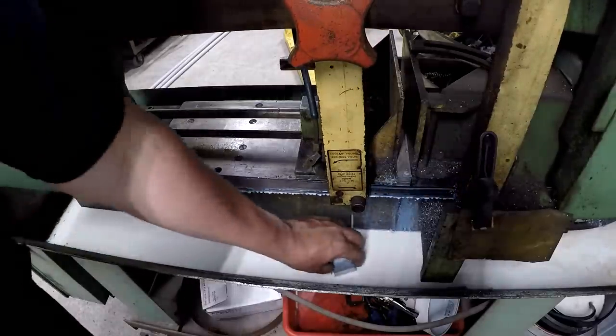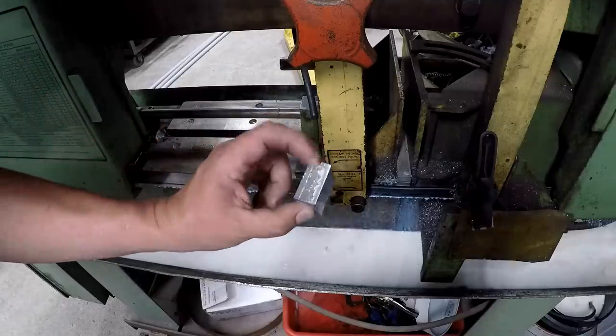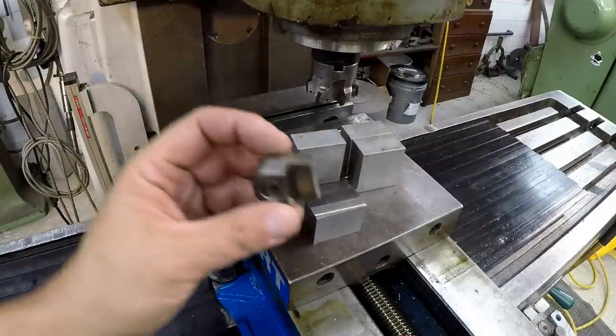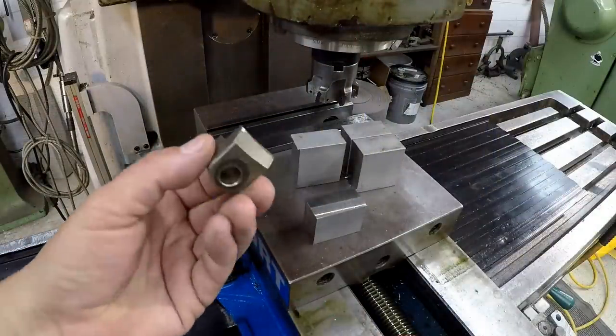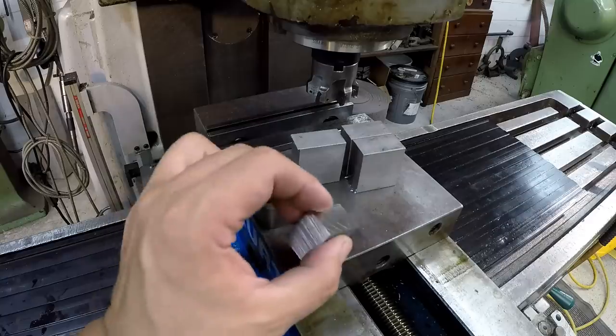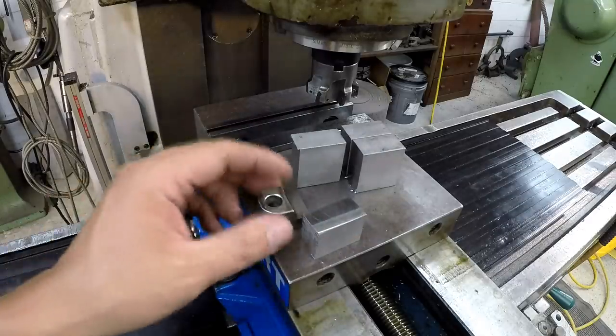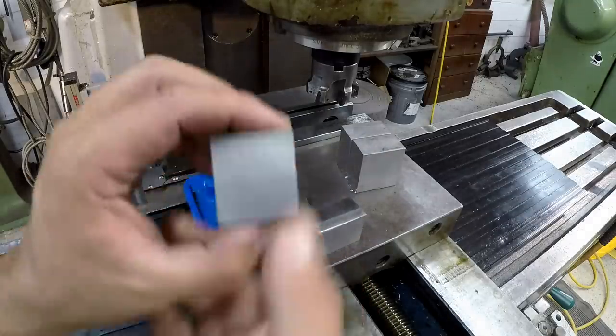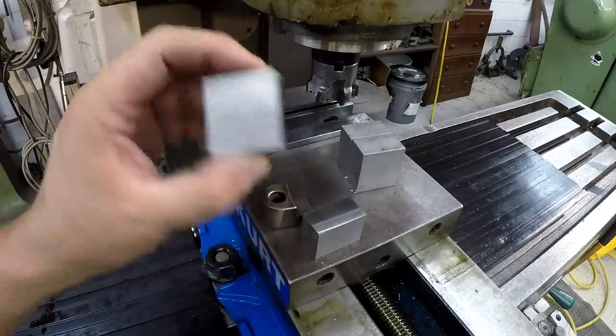That's all 8 of the blocks in that stainless steel, and the blade's doing great. All right, we're going to start getting this guy right here, the blocks for this one milled to size. So I've already started on this one right here, just making sure that my setup was good. And we're just going to take one of these, and this is 1.5 inches. This way, we're going to bring it down to 1 inch.